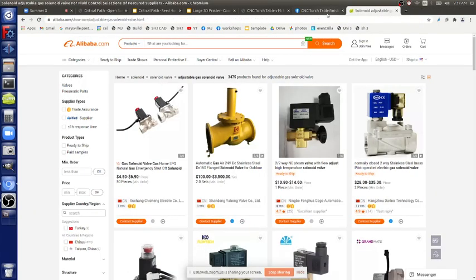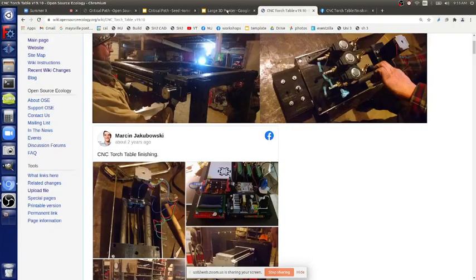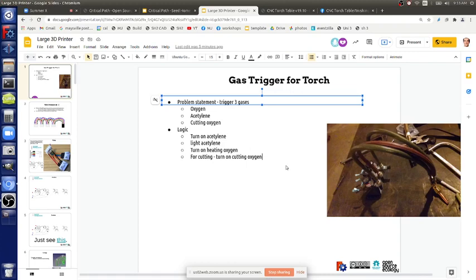You set it once, and then you turn either the high flow for acetylene or you turn that off and turn on the low flow acetylene valve, because they're in parallel, feeding into the same aperture. Cool. So we can do that inexpensively, and these are like 20, 30, 40 bucks each. So that's the logic. But let's look at the Arduino Mega, the RAMPS. Let's look at what we have available to control this.